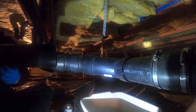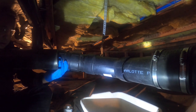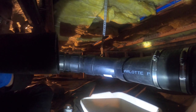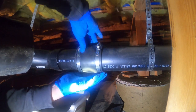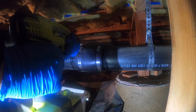I figured it would be best to start my install at the sewer line and then make my way out to the RV pad, because if I made a mistake it would be easier to remedy it somewhere along the extension line to the RV rather than having to recut the sewer line. The last step on the sewer line is making sure the coupling is in place and then tightening down the clamps.